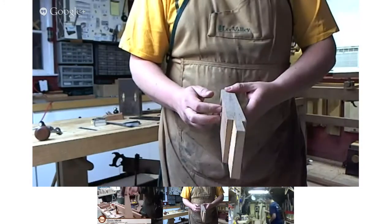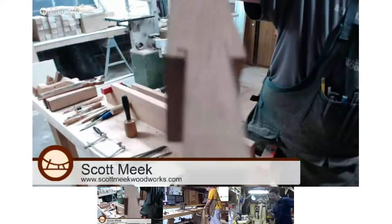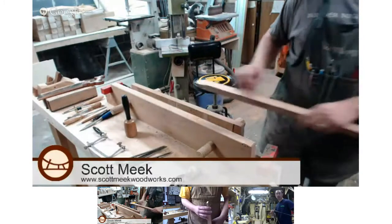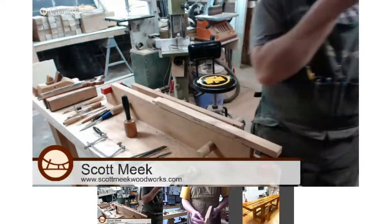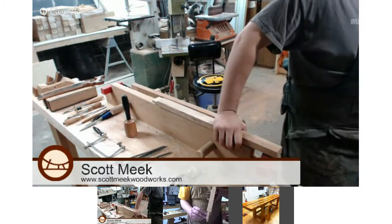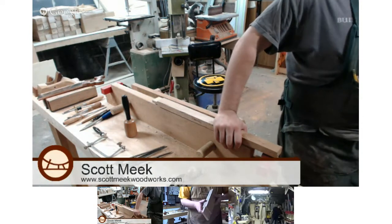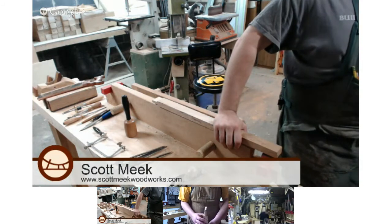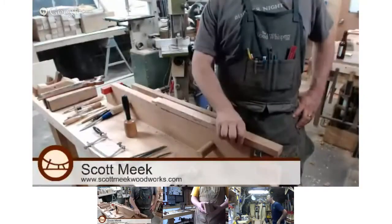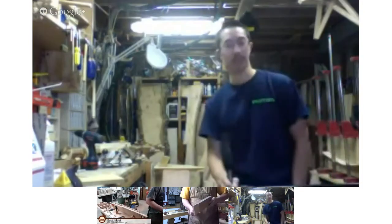Tenon. Yay, tenon. So basically that tenon would split the mortise. I've got a bit of a wedge going. So if I can clean it up with my router plane, I'll be all set. I think I'm pretty good here. I can see a little bit of my knife line right there, and a little bit of the knife line right there, but I bet I could hammer that home. Cool. Pretty good across the thickness, too. Of course, I'm using nice soft mahogany, so it makes things real easy. There we go. That's it.